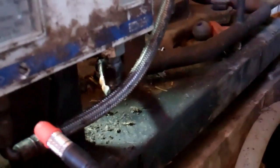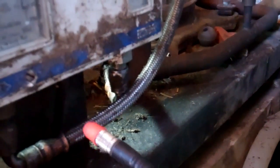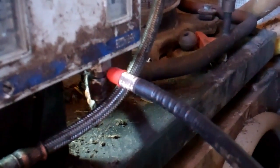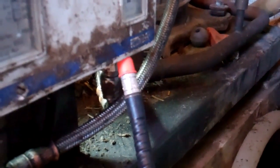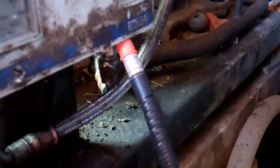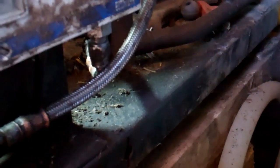I was just going round the connections on this Alco pressure switch, checking the ends of the hoses because they looked a bit oily. I couldn't pick anything up — but as soon as I went round here, it goes off the scale on the detector.